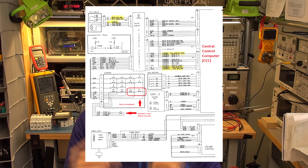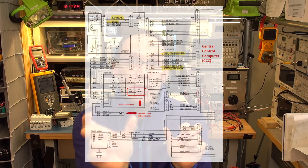This manual is for a slightly different model, and I've looked for those physical title control switches - I don't think my model has them. The logic there is that if the switches work, it's more likely the keyboard is at fault, because working switches confirm the wiring back to the central computer is fine. But I didn't have that option. The manual then says to check connectors and the wiring loom. If both switches and keyboard aren't working, it's either the wiring loom, physical connectors not making proper contact, and then the next port of call is the central control computer.